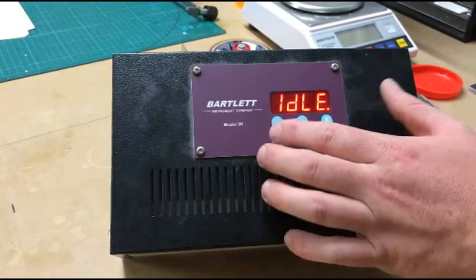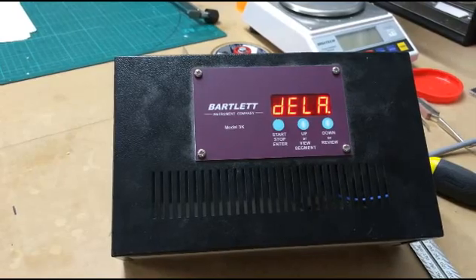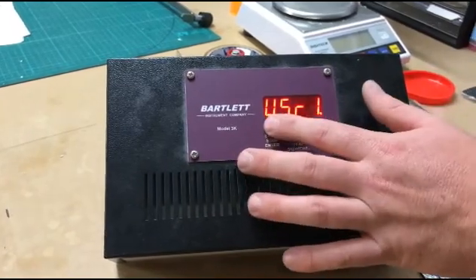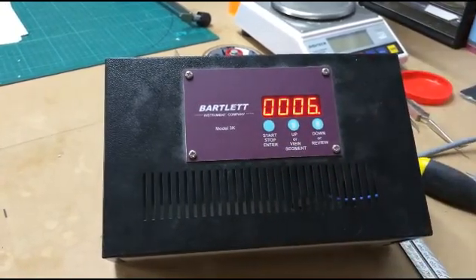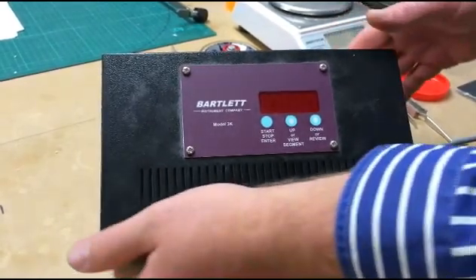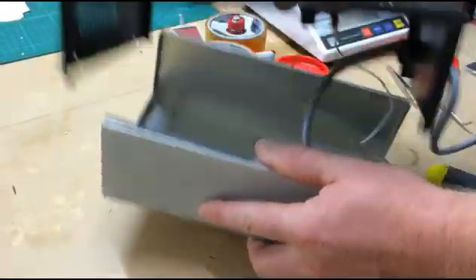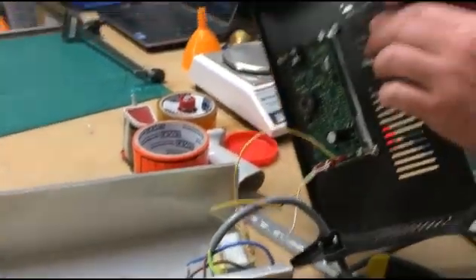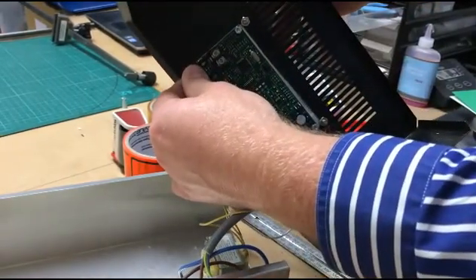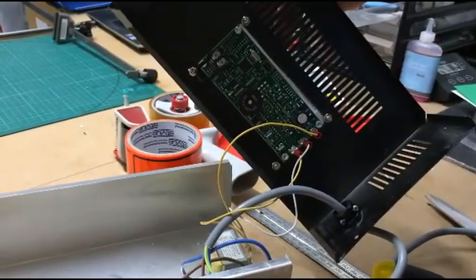You'll also notice on these models that when we go to start it and press enter, the first step is it asks you for a delay before you fire. With glass we basically never use delays, so just press enter. That takes us to User 1 — all the same steps apply as the other model. An interesting point: I currently don't have a thermocouple connected to this device. What we're doing instead is a thermocouple test — this little piece of wire here goes in where your thermocouple would usually run. All it does is bridge it, and it senses local temperature only.